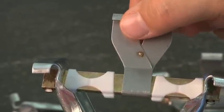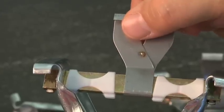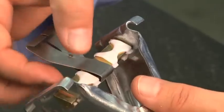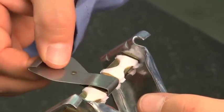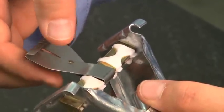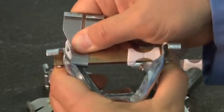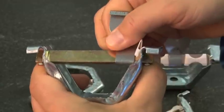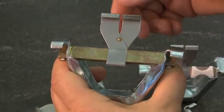The high-strength steel triangular bar is plated, which allows the stainless steel tab to move freely with the forces of thermal roof movement. The plastic centering sleeves keep the stainless steel tab centered on the clip until installation is complete. These centering sleeves will break away with just a few pounds of pressure when the roof starts to move, and will fall harmlessly into the blanket insulation.